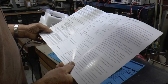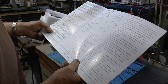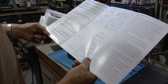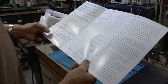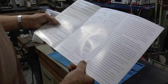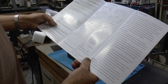Let's see real quick. Peak current 200 amps for 3 seconds. Discharge cutoff 10 volts. Discharge temperature minus 20 to 60 centigrade. Water dust resistant IP55. Terminals are M8. You can put 8 in parallel and 4 in series. Here it says 12.8 volts, 100 ampere hour. Minimum is 98 ampere hours, 1280 watt hours. Standard charge current 0.2C, maximum charge current 0.5C, maximum continuous current 1C.